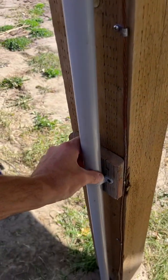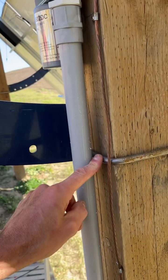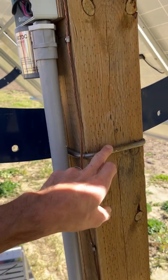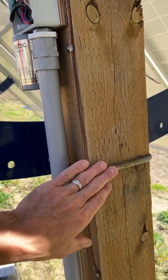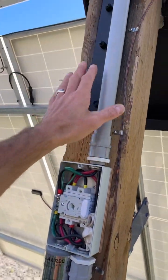Stabilizing brace here for the conduit — again another spacer, because this is my securement for my tilt array. We're able to undo this and pull these guys back. These are going to be coated — we just had to get them on because we were using C-clamps. We'll get these coated up so they don't rust, just like everything else.